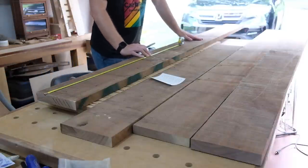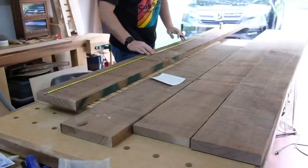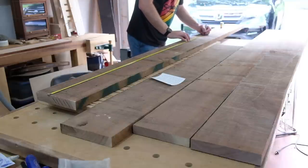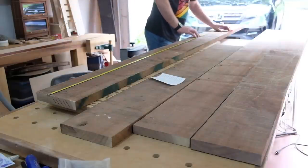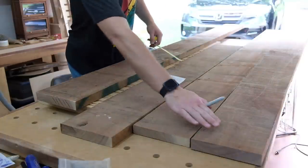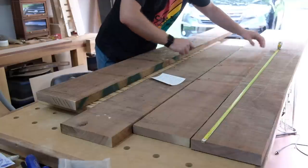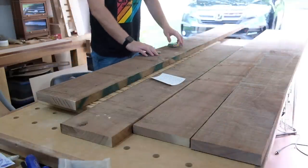So this board is pretty clear, I don't see any knots on this side of the board. I'm just going to go ahead and mark all of the panels I can get from this length, and that way I'll have a nice color match on the outside case. So I'll do 32 and I'll do 62 — that's another 30 inches for a side. And then this last chunk here will be enough for another side. I'll mark another 30 from this board, which will be my last side. So I'll have two sides and then a top and a bottom, and that'll be my casework.